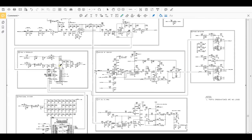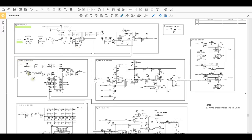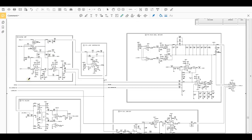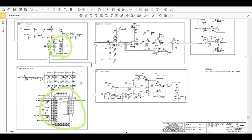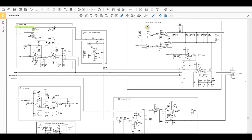Here we have the YTO prescaler — YTO2 and the prescaler — a good section to look at. This is the section that had a problem before. Here's some fractional N and prescaler. If this component is dead I don't know if I can find a replacement. There's a divide-by-128/129 section we can look at later. Phase detector, fractional divider. Another component here which if dead I won't be able to replace. Here's the charge pump as part of the PLL, and the main coil driver and FM coil driver — no surprise both are close to the charge pump. Here's the YTO unlock section with two LEDs that tell us if the YIG tuned oscillator is unlocked — they can be seen at the back of the board.